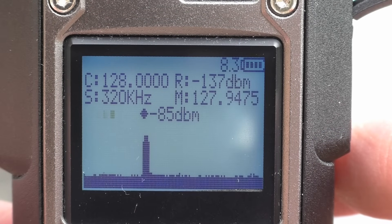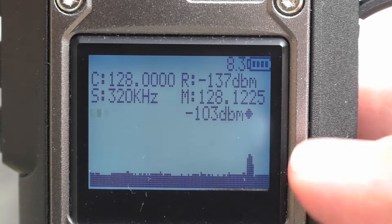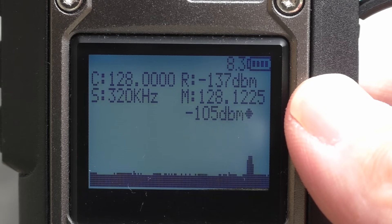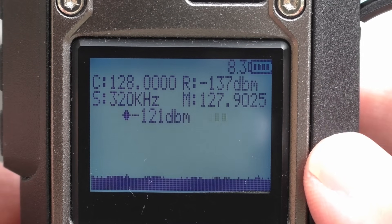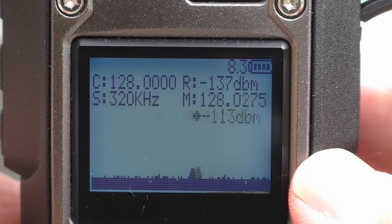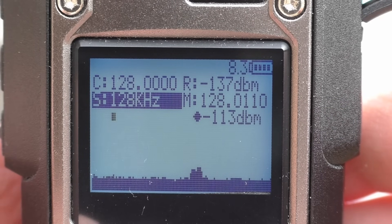That seemed to work quite well. The bandwidth control — how much you're going to see on the scope — does go up quite high to 1600 MHz, but that slows things right down, so setting it around 128 to 200 works well. It was off to what I thought was a good start. When the scope receives signals you see a little dot appear just above them, telling you the frequency and how strong they are. But the problem I found straight away was we weren't getting any audio — everything was still squelched out.